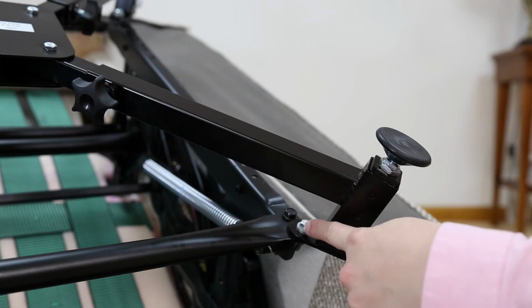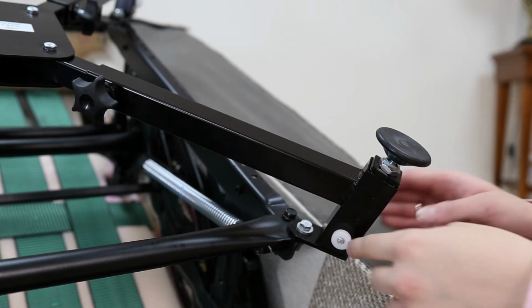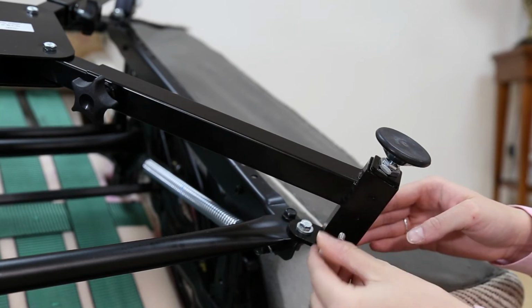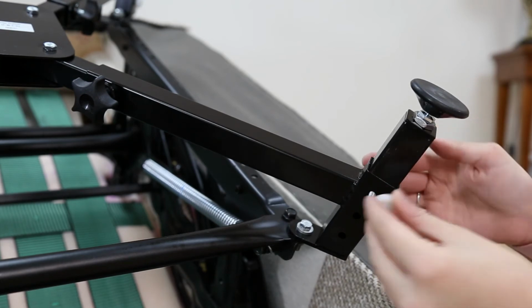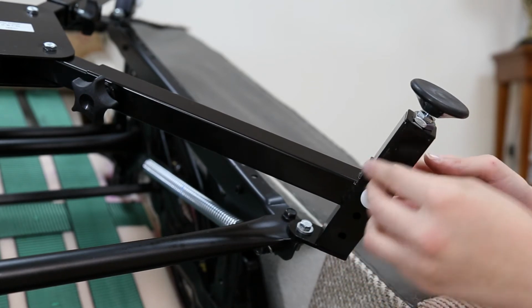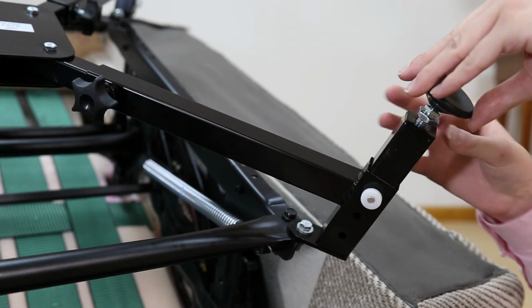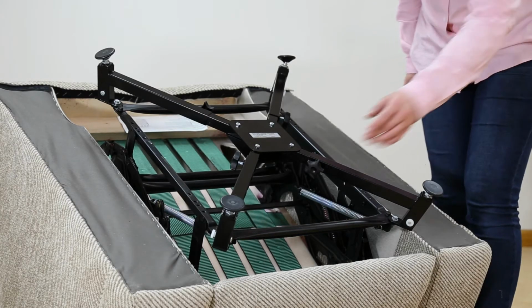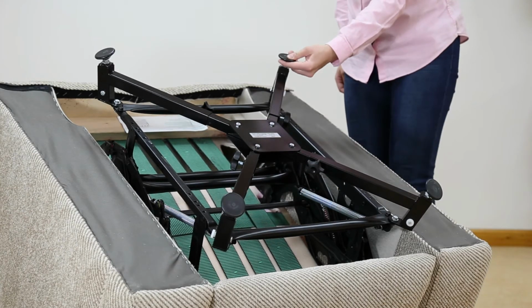Here was where the tipping point of the chair was. With our raiser, the tipping point has been stepped out, giving it the extra stability. Select which height option you would like using the screw and nylock nut. The feet of the raiser can be used as levelers or run out to achieve an even higher raise. Push the two front feet down and make sure the two back feet are level.